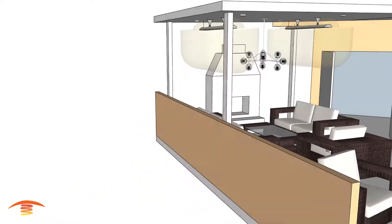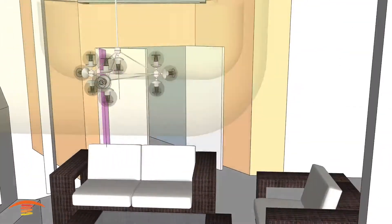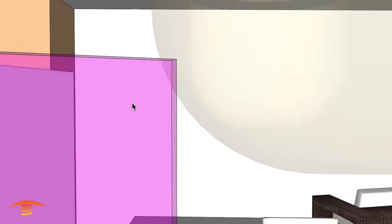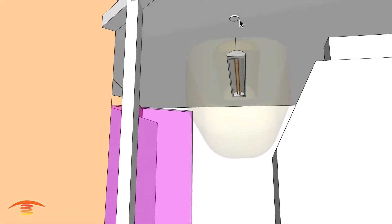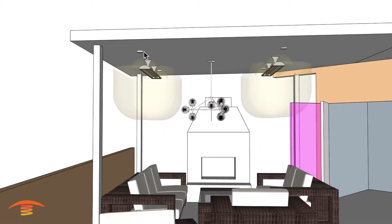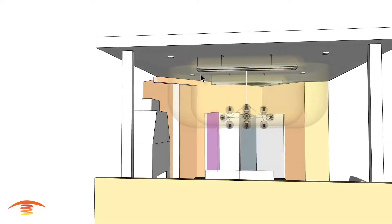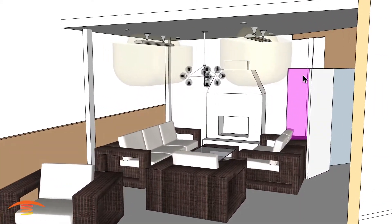I don't see any other issues with the exception of this door. I have this door out further and you can see I'm just penetrating the door — if it's a wooden door we're going to have to move this a few more inches in, which would not be centered within these lights, if in fact the lights are even placed in the right position. They're 8 foot center to center — maybe they're 6 foot, maybe they're not quite that far — so something you have to be concerned about is that we don't penetrate that door.